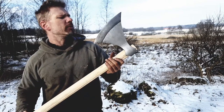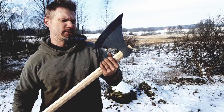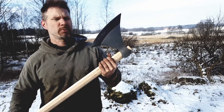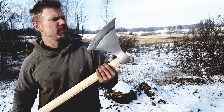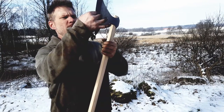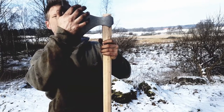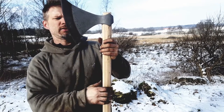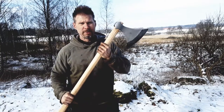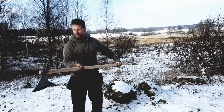I'm going to make it shaving sharp but not razor sharp, because a razor edge wouldn't hold up to the damage this axe is intended to do. You need what they call an apple seed edge — it's actually a little bit convex at the edge, rounded to give good support for the cutting edge. Right now I can barely cut myself even rubbing it hard, but I will make it shaving sharp with that rounded edge.